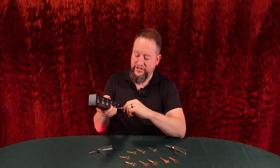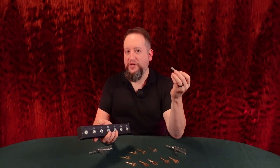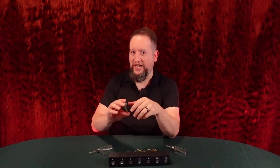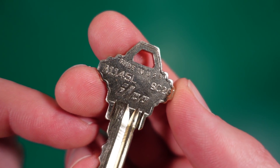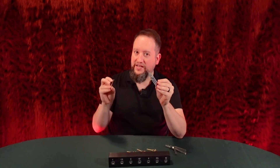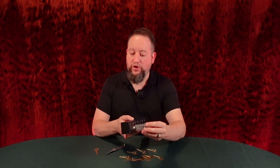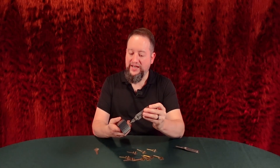Here's our F key, here's our FG — the visual of having this block just sells it. Would it make sense for there to be a super top-level key? Yes, that exists. In most multi-section keying strata, Schlage is not unique in this regard — there's a super top-level blank, an all-section key, used for top master keying, grand master keying, sometimes control keys. In Schlage's classic series, that is the L blank. It is very thin, usually manufactured out of steel. In the lock supply world — Kaba Ilco catalog and such — you'll hear this called the SC20 in six pin, and SC19 in five pin. That is why this pick is named the SC20 pick: it has the L profile. The SC1 and SC4 picks will only fit in the C profile. The SC20 will fit in absolutely every one of them.